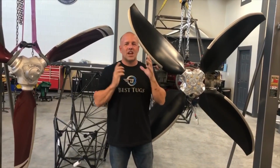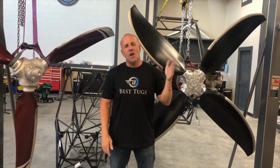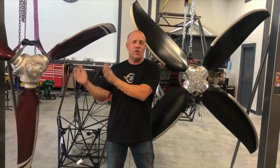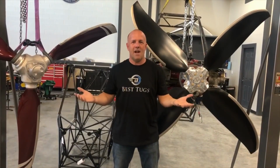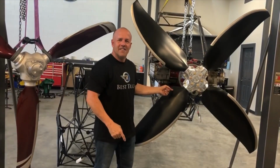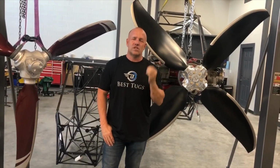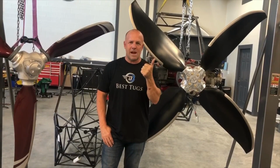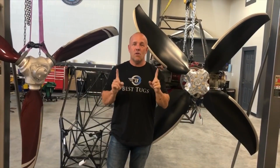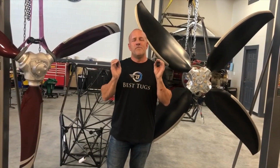But an aircraft like a Carbon Cub takes a specific horsepower to do a specific speed. It doesn't know if it's 2 cylinders, 3, 4, or 8. It takes, let's say, 100 horsepower to do 100 miles an hour. I'm going to use rough numbers. It's actually not quite that much. But if I take this 8-cylinder and pull it down from 500 horse to 100 horsepower, there is an exact fuel specific that says this many gallons per hour produces this much horsepower. It doesn't know if it's 8 cylinders, 4, or 6. So, other than rotational mass and frictional drag of the additional cylinders, they will pair up.